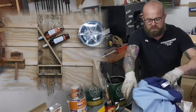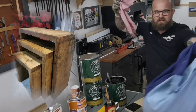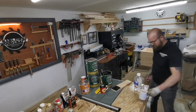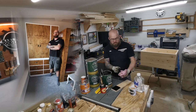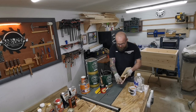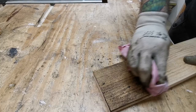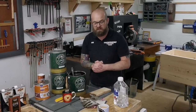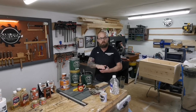All I do is apply it with a brush liberally, and if you want it darker, leave it for a few minutes; otherwise wipe it off straight away with a clean rag. Top tip for clean rags — get all your old sheets and bedding and cut them up. As soon as you've used these rags they need to be disposed of appropriately because they can self-combust. You rub it off with a clean rag and you'll see the lovely finish you get. Apply with a brush or a rag, leave it for 10 to 15 minutes, and buff it off to a sheen.